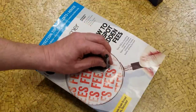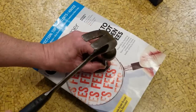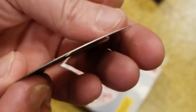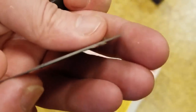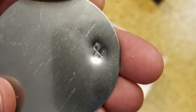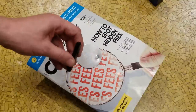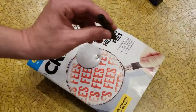A magazine is a pretty optimal surface that allows the sheet metal to deform but also provides a fair amount of structure. Very easy to upset sheet metal, but if you have a little magazine under it, it really doesn't cause it to deform too much. And we got a really nice crisp stamp. You can always go back and fit it right into the same spot and hit it again to get a deeper stamping — you don't always have to get a deep stamp on the first hit.